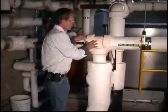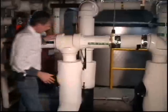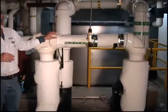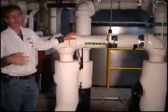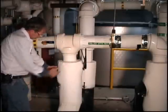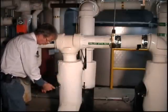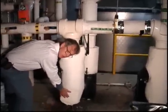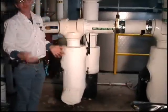There are two pumps in parallel — you can see two drops beside each other. One of the interesting things about these pumps, and this is a little commissioning lesson, a little value engineering design review sort of lesson: these pumps have strainer problems. There's a y-strainer blow-down valve here, and you can't tell with the insulation, but there's actually a suction diffuser inside there.